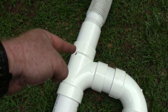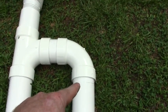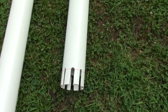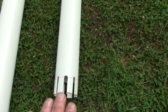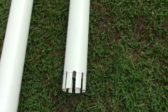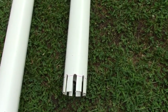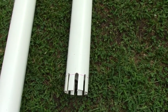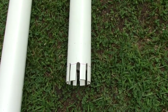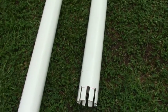Then, if this pipe is filled up, the rainwater is diverted over here and through this elbow, and right here is going to be at the top of our tote. So then we're inside the tote, and we have this very long pipe that comes down to the bottom. The bottom of the tote will be right at the bottom of this PVC pipe. We've notched it open to let that water come out, and it's forced out at the very bottom of the tote. There's going to be a lot of churn, especially in a hard rain. So anything that's lighter than water might get flushed out here. We're trying to get some cross-tote churn of that water to keep it all fresh — we're forcing the rainwater to come out at the bottom so anything that settled to the bottom of the tote is also churned up and mixed in with the regular water.